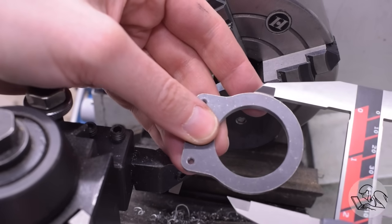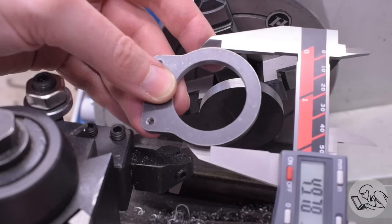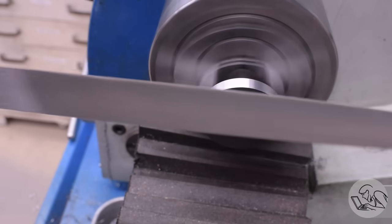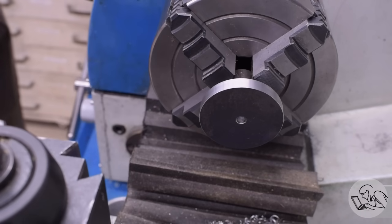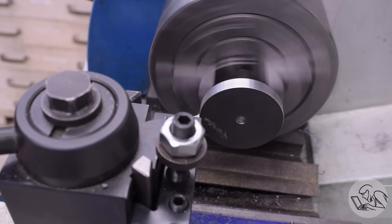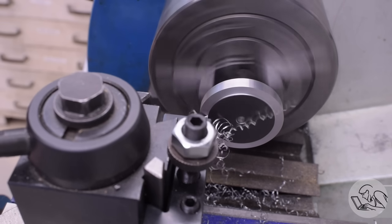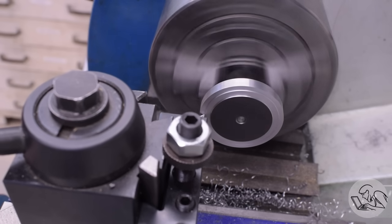I'm actually going a little bit undersized on this part because I know it's supposed to line up aesthetically with this hoop thing that we just did. The outside of this hoop does not get finished — it's still laser-cut and it's actually a little bit undersized from the factory. So I'm going to turn my piece a little bit undersized to match it, just so it'll look nice when all of these pieces are stacked up. Next up is the big shoulder feature. For that, I'm going to switch out to a left-hand turning tool because this is going to be a pretty heavy facing cut. A tool like this on the back of the tool post will do a better job than my tangential tool, which works fine for light facing cuts, but the tool geometry of a tangential tool is not quite correct for cutting forward.